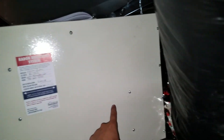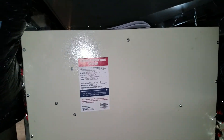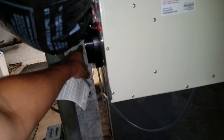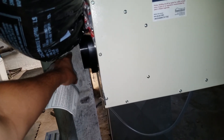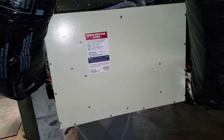When the outside air and the indoor air cross through this coil, energy is transferred. Right now we're sucking in about 90-degree air and exhausting 70-degree air. And the result — instead of 90-degree air coming out right here, it's only about 75 degrees. We're only adding 5 degrees of temperature to the indoor air, because this 70-degree air is touching this 90-degree air as they cross paths without actually transferring the air itself.